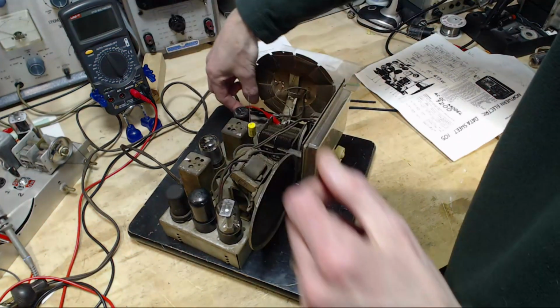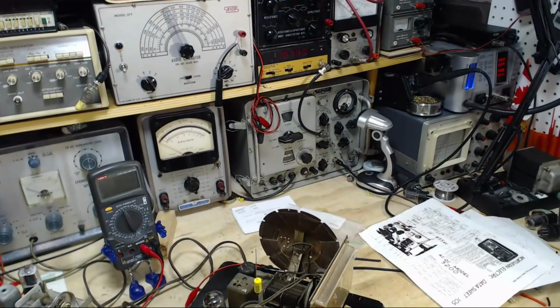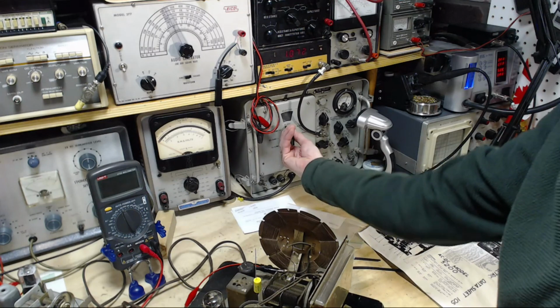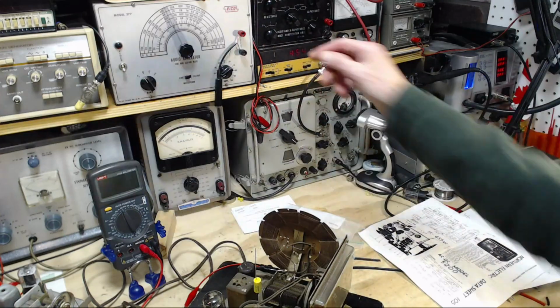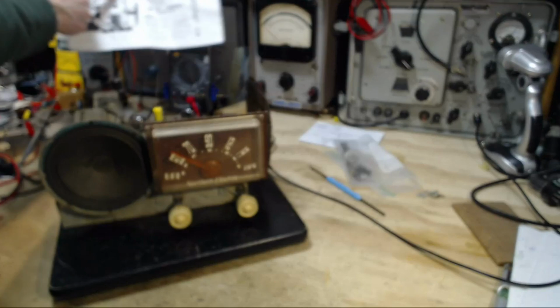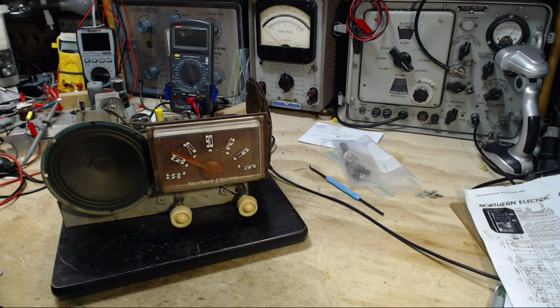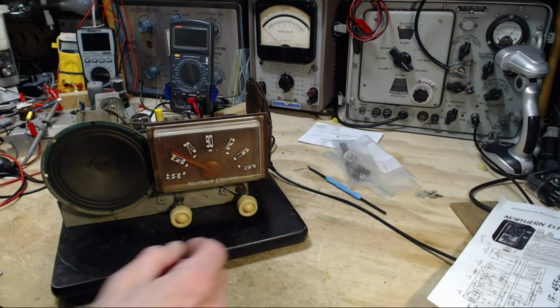Okay. We'll leave the signal off for a minute. Turn it down, and we want this set to 455. 455 in the big print, so that's 455. See? 455. Can't miss that. One of you was pointing out that somebody took the time to write the IF frequency gigantic on this page. So that's what I'm playing off of.